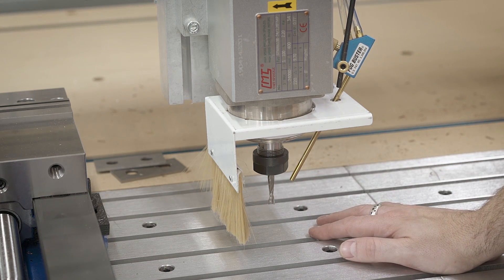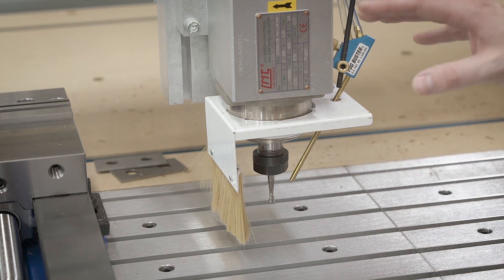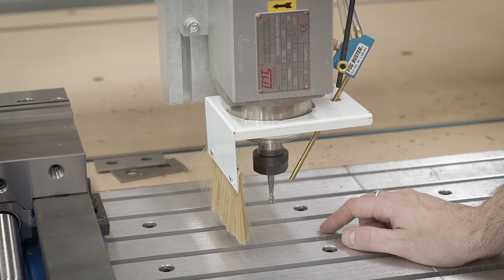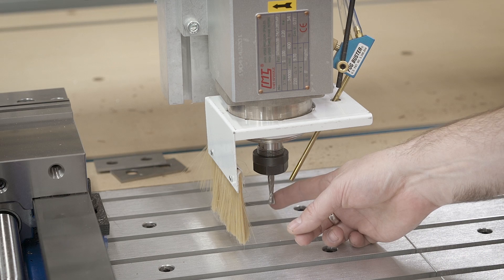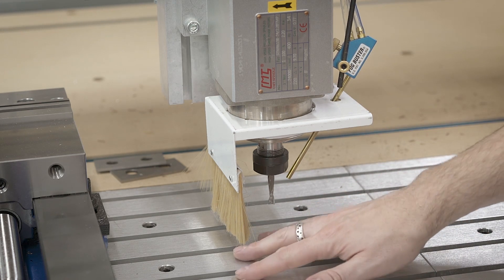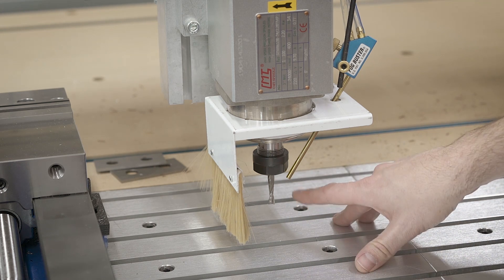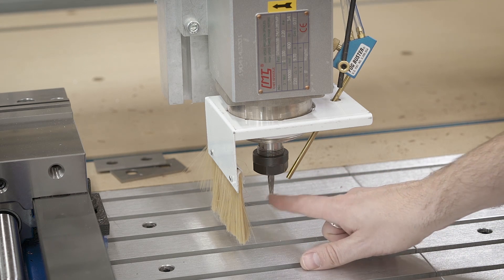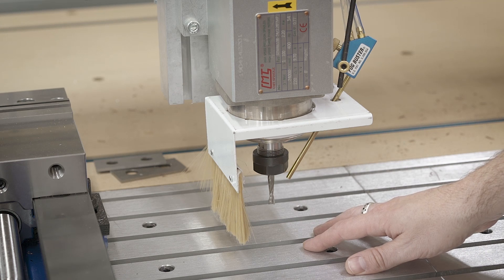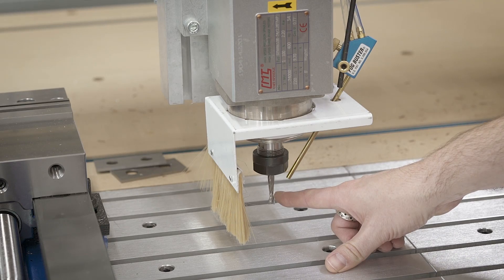With this little needle valve you can control how much coolant comes out of the nozzle. The interesting thing about a fog buster is it doesn't give you a mist — it doesn't atomize the coolant at all, which is hence the name fog buster. It just kind of spits or sprays the coolant directly at the end mill, and instead of flood coolant, it's mostly the airflow with just a little bit of spitting that will almost instantly evaporate at the end mill. The cooling comes from the air blast, blowing away chips, and lightly spraying the end of the end mill.